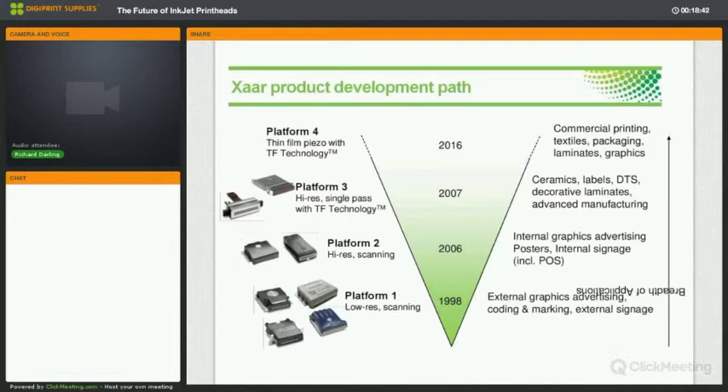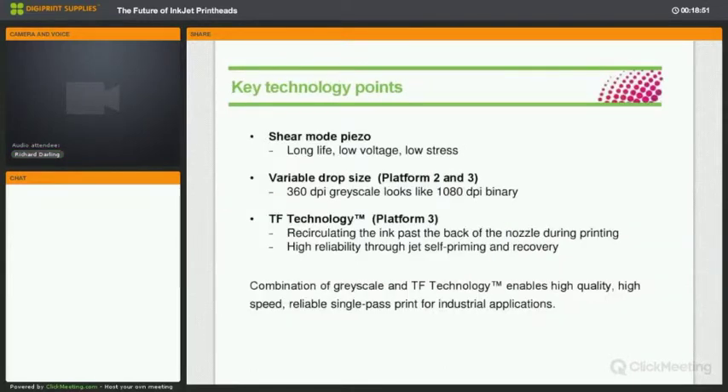From now to 2016 there is another platform — a completely different platform — that moves from bulk piezo to thin film piezo. Our current technology is based on shear mode and chevron actuation, where two pieces of lead zirconium titanate with opposite polarity create an acoustic wave in each chamber via an electrical energy pulse. Our technology is generally proven to be a low-stress, low-energy environment — you get more movement of your fluid for less energy input, the printhead is less stressed and should last longer, and you generate less heat.